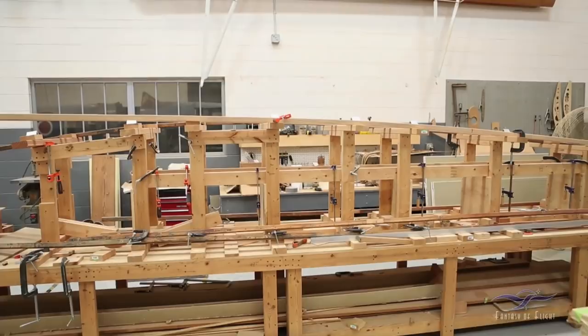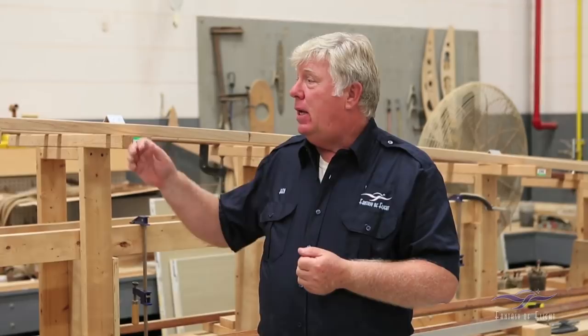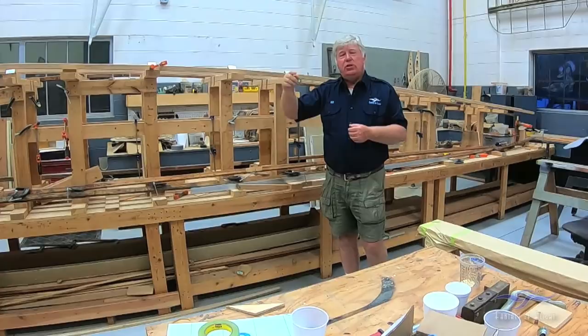So that's where we're at. We've got them now. This is our jig here for the fuselage. I actually put the original fuselage here and built the jig around it before I disassembled it. Now we're going to use that same jig to bend these members back to the correct shape that they need to be, and we're going to do that by steaming. I'm going to pull this longeron — I've got a steaming tube over here that we're going to show you — and I'm going to insert that tube. We're going to steam this thing for several hours and then we'll see how it's going to bend in the jig.